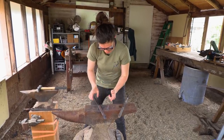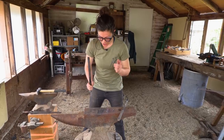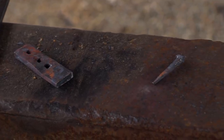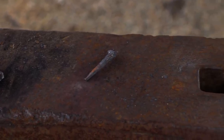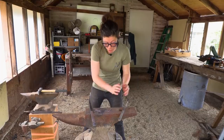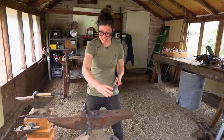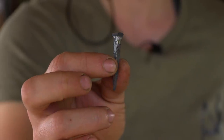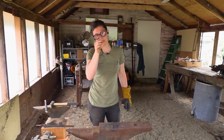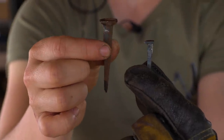Back to the project — as you can see my nail header totally failed. I clearly didn't have my welding settings right, so I'm going to take a look at that and fix it. Thankfully it's fully salvageable and we got our one little nail. Like I said, they should take about three minutes if your equipment and your operator are both working correctly. So let's shift gears and make another nail header by forging this out and punching a hole in it. It's pretty exciting to be making these again — although this one is a little golf club shaped, which isn't ideal. You really want to get the head centered over the shank of the nail, but it'll work just fine.